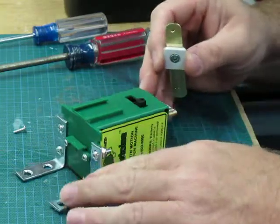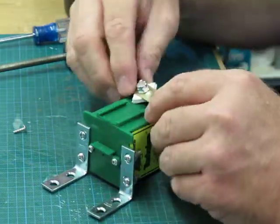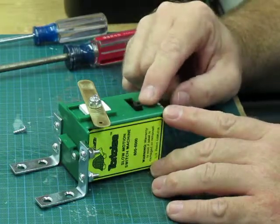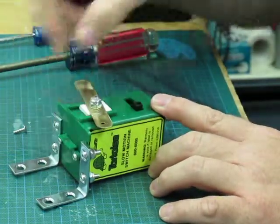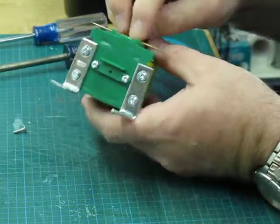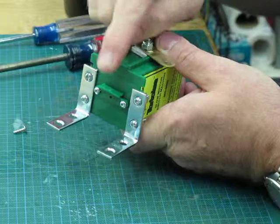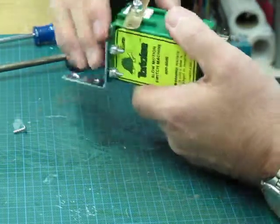The next step is to insert it into this slide. The only problem is that it's usually a tight fit, but sometimes it will slide up through and fit just past this piece. If you've made your block a little long, you need to clean out a little lip on here — you can use a knife, then file it down and slide it in from the other end if your block is too big. So you have more than one way of getting it in there. If it happens to fit, perfect — then you don't have to go any further.